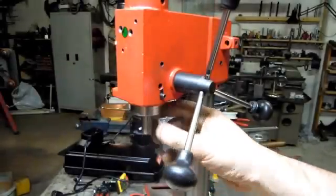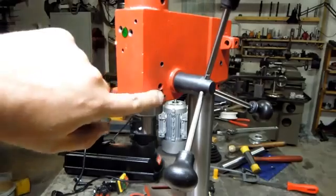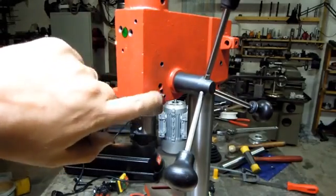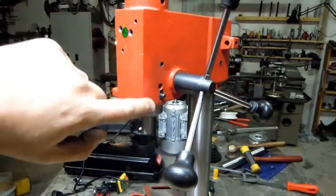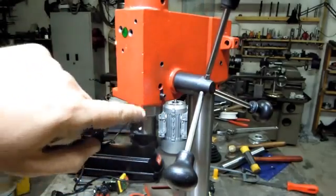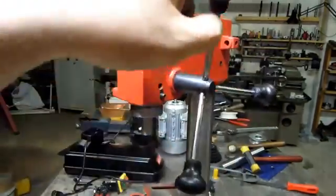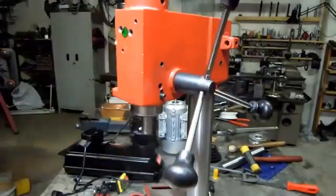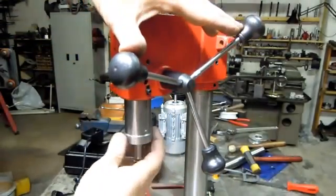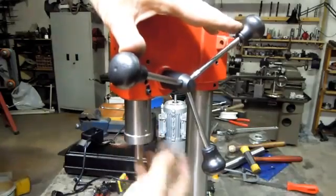I've got the new quill and the new bearings installed preliminarily. I also drilled 2 new holes for adjustment screws in the thicker sections where the support material is. I've only got one in there now because I've only got one of the right size. But so far, it feels pretty good. So at full extension, a lot better than before.